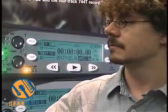The nice thing about this on set, if you're going to be in more of a fixed cart situation, is you can now control the device with an external keyboard. So now you can enter scene names and metadata, which is becoming a very important thing, especially when you're recording lots of files and want to take notation onto that. The 2.0 firmware offers iXML metadata that's readable within Pro Tools environments and other iXML-aware applications.